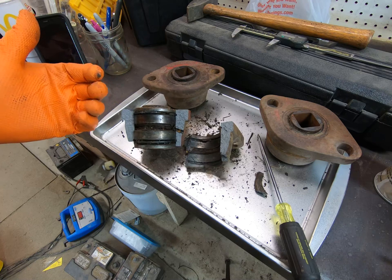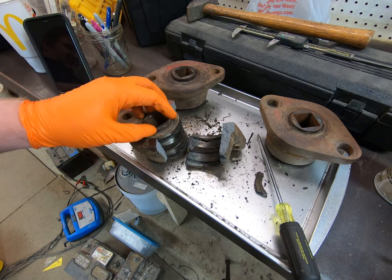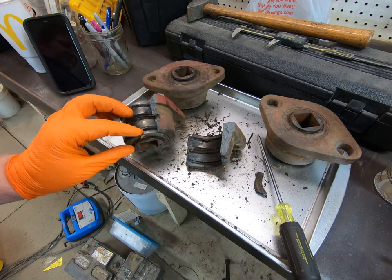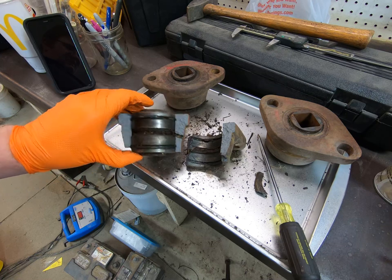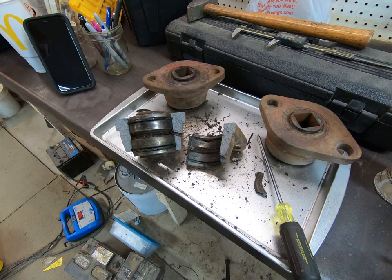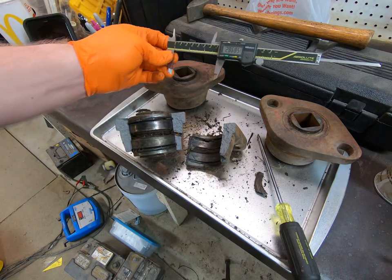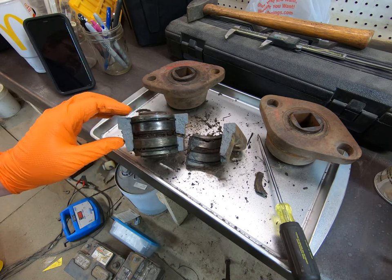These aren't serviceable, so I have to find a bearing set or bearing assembly that would fit a one-and-an-eighth-inch square arbor that goes through the disc. I want to say these are about 2.8 to 2.9 inches wide. I've got to figure out what to do there. It's not necessarily a huge deal overall because I can move the supports wherever I want, but the big problem comes on the very end — I've got to make sure I can take up all the slack with the nut on the end of the disc.